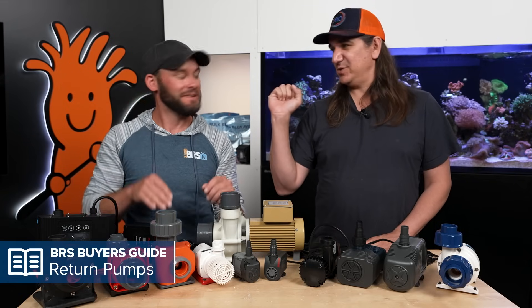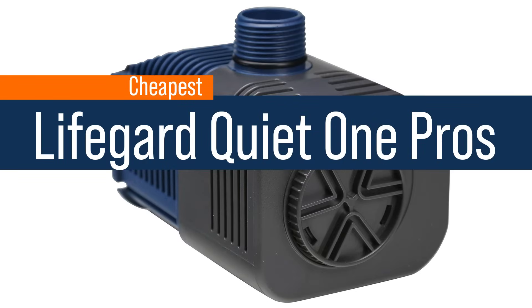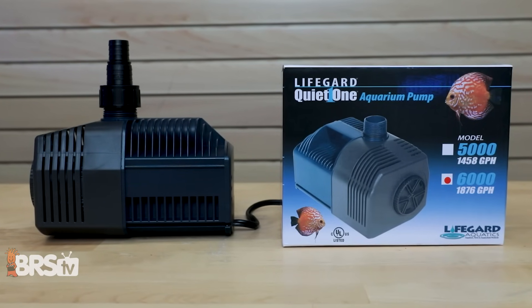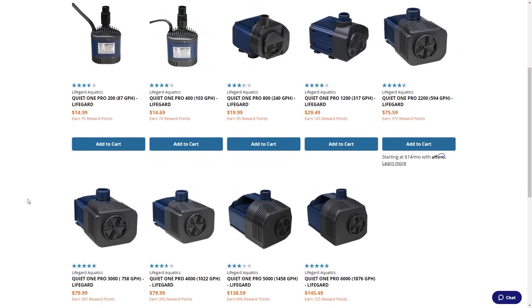The goal is for you to say, 'that was for me — they had my priority.' There are about seven priorities. The first popular one is: what is the cheapest option that gets the job done? That's AC pumps — Lifeguard, Quiet One Pros. They're not full of bells and whistles like DC options. It's a pump that works and moves water, which makes it cheap. If you're looking for the cheapest option, Lifeguard is your pick.